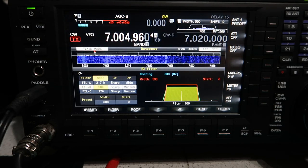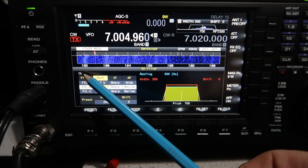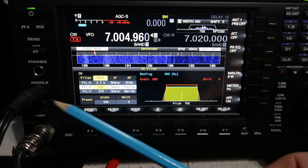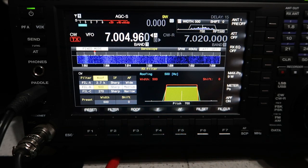Press and hold the IF filter button to pull up the configuration screen. We've got a roofing filter selection, an IF filter selection, and an audio filter selection. For every mode there are filters A, B, and C. I've got the optional 270 Hz roofing filter, so I've configured wide, not-so-wide, and narrow - 2.7 kHz, 500 Hz, and 270 Hz widths. Roofing filters keep all the interference out - anything outside that bandwidth doesn't get in, giving very good strong signal rejection.